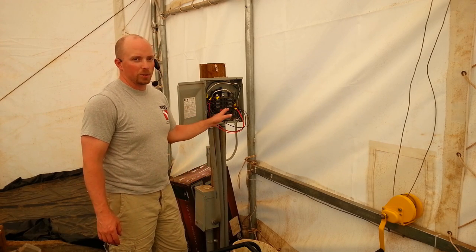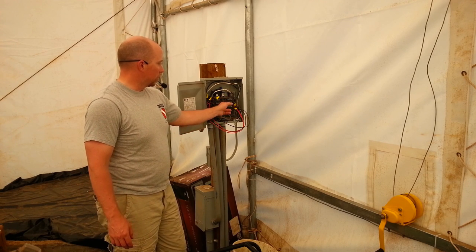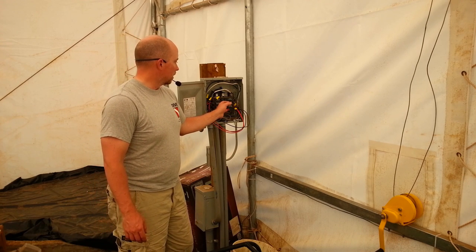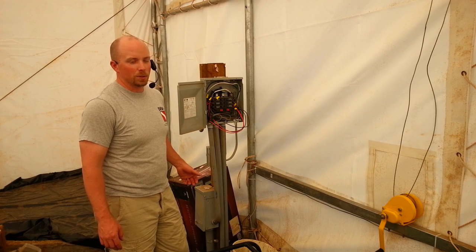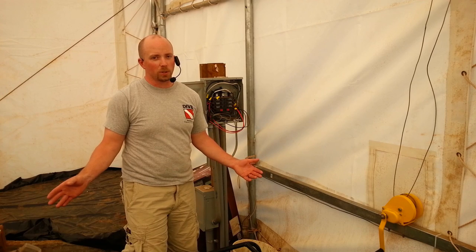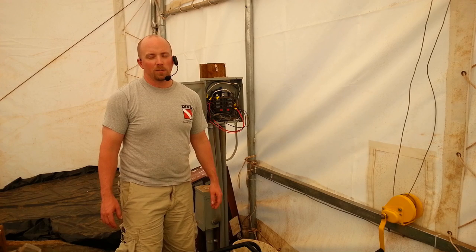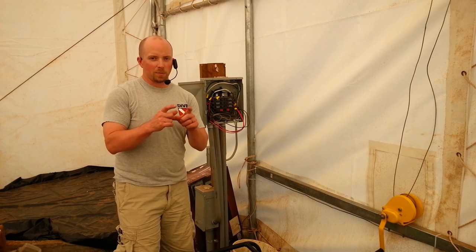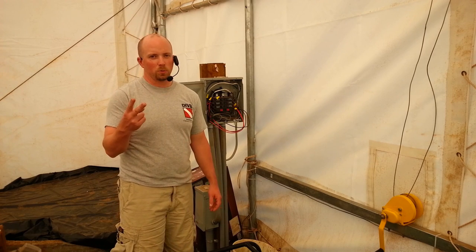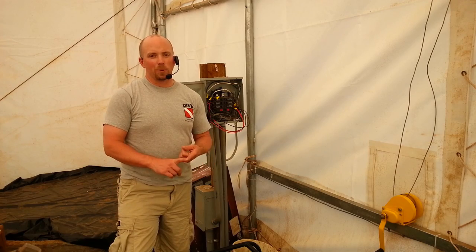So we would rewire and redo this whole thing. If we go with the pumps, we'll have to double up — put double breakers in for some of these 15-amp switches — so we can free up two spots to create the 240-volt circuit. Heating is also something we may need to do, so if we need a 240-volt circuit just for heating, we'd take the empty spot and double up another 15-amp breaker with a double circuit breaker to get two 240-volt circuits. I think if we did that, we'd probably be good.